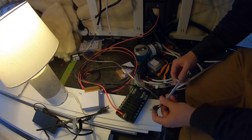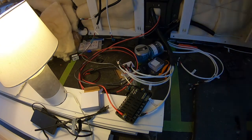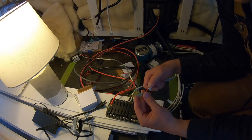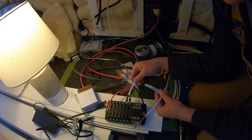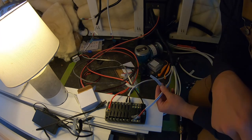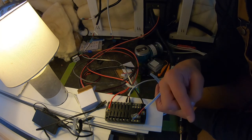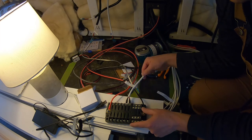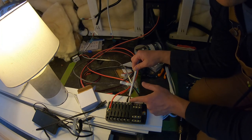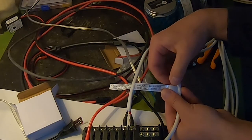My plan is to go through and cut back the wire so that the negative and positive can fit into the fuse box. Before I go further, I want to explain something so I don't get comments saying I did this wrong. For the light switches for both the bed and the living room, I didn't want to run two separate lines. So I decided to put both the red and black going to the first switches - red is bed and black is living room - and made labels to indicate that.